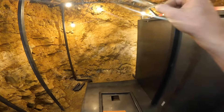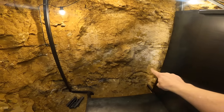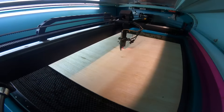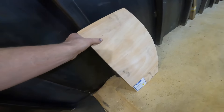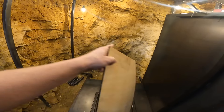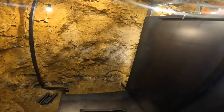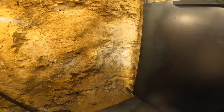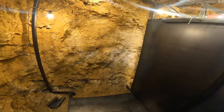Wall up. Next bit is this end wall. I'm going to stick a little recess window, a little bit like I did with the pump down the other end. I've laser cut myself a profile which I can plasma cut round. There's like another 500mm of space and rather than just filling that all up with concrete, let's make use of it. It's not just going to be a tunnel - it's going to be a utility tunnel.